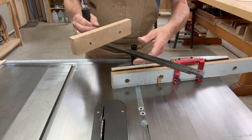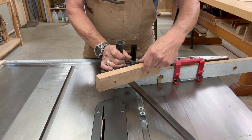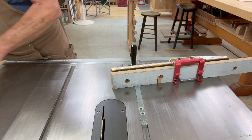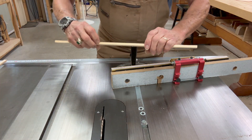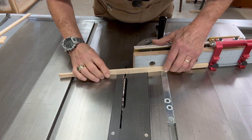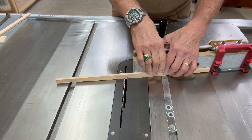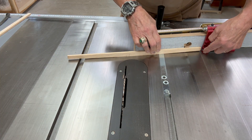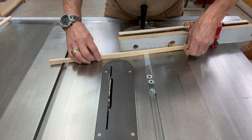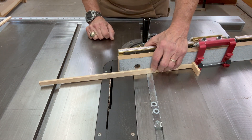You can do the same thing without any of this — if you've got a simple miter gauge, you can still establish the correct angle and you'll just want to put a longer guide rail on it so that you can accommodate the length of your work. You don't need any of this expensive stuff to do this job. So I'm positioning my brace so that the right side of my saw blade is touching the mark, it's hitting the joint, and I have adjusted this stop so that a scrap block sits in there. I'm going to put the scrap block in, line this up with a saw tooth, and adjust my stop back and forth until I hit that point. Pretty simple.